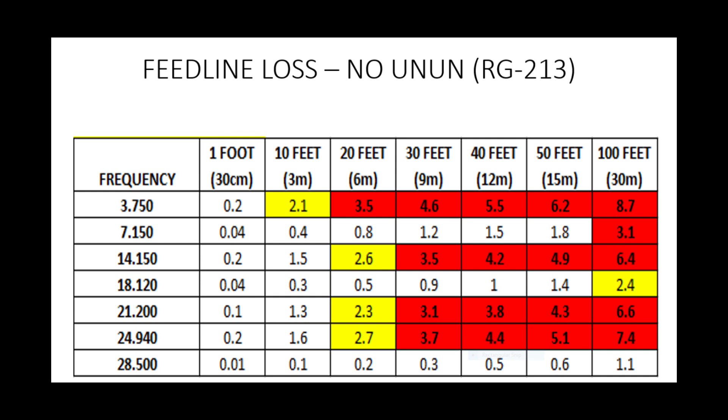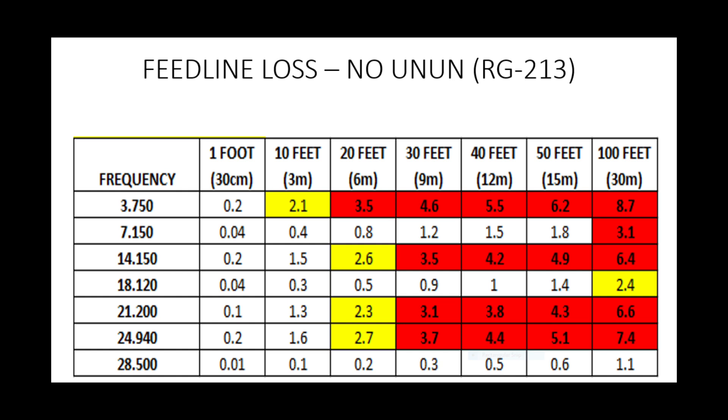20 metres is also a bit challenging, as are 15 and 12. A lot of people say that some manufacturers recommend a certain length of coax to bring the SWR down — no doubt that's true. If you're suffering 6 to 8 dB of loss, you'll likely see a quite reduced SWR in the shack compared to at the feed point. But whilst you might be happier with a lower SWR, you're going to have quite a degree of loss on the feed line. The worst case: with 100 feet of RG213 on 80 metres you're losing 8.7 dB; substitute RG8X or RG58 and you're probably looking at excess of 10 dB.